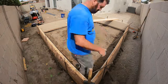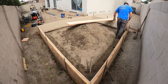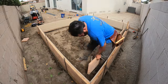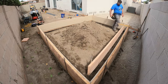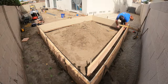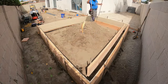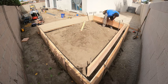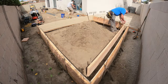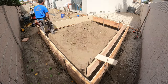Because I did underpin and I want that nice flat smooth edge going down below the concrete on the exterior, I had to run another 4-inch of siding below. You don't have to use siding — you could potentially use any 3/4-inch stock since you're not going to see the bottom anyway — but you need that width to continue down because this yard is kind of on a skew. The whole planter bed is as well, so there are no 45s or 90s — it's just whatever degree it is.